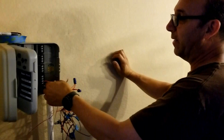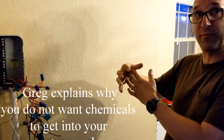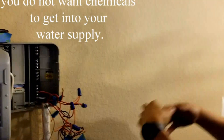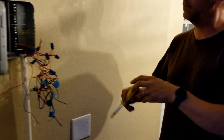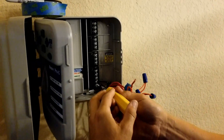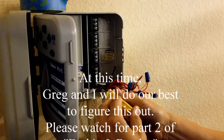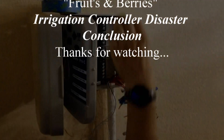So it separates it from everything else. Once the system shuts off, that valve closes. So basically you have two valves between any chemicals in your lawn and your water supply. A check valve is a spring-operated valve that opens up and water presses in to flow into the system. But once that water shuts off to your system, those valves close. So if you have any chemicals in your lawn, they can't leach back into the house through the water — like over the winter months. Chemicals could get in there and leach back into your house and you'd be drinking your chemicals, which isn't a good thing. Okay, PMV — there you go, all disconnecting.